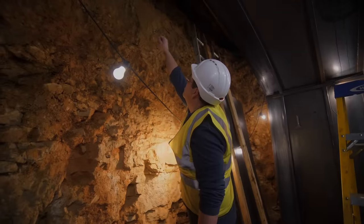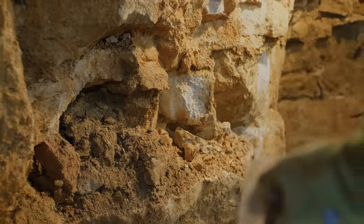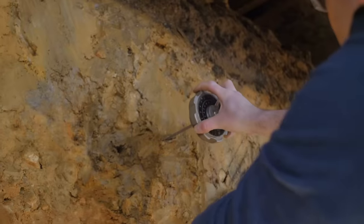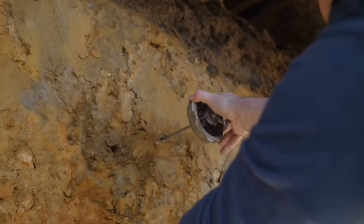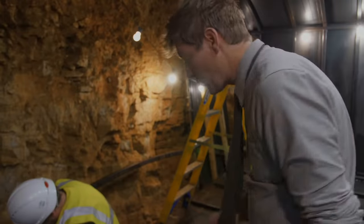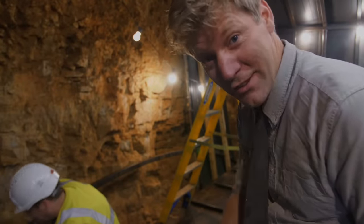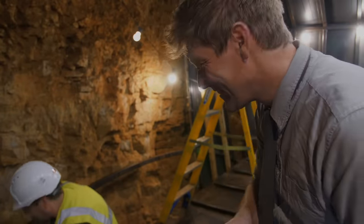We can calculate these forces quite precisely because I had a geotechnical survey done. Basically a specialist comes out, takes rock samples, sends them off for crush tests, and uses a twisty device to measure how firm the clay is. We tested it — we're in firm clay. What comes after firm? Stiff. After firm is stiff, then very stiff. We got firm.